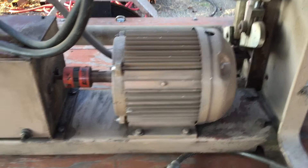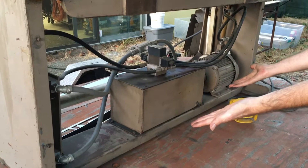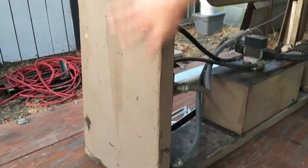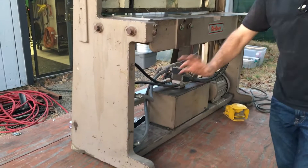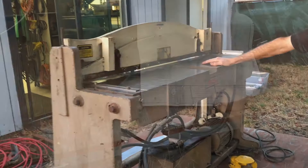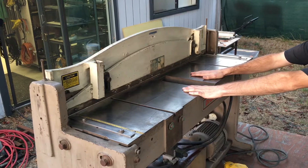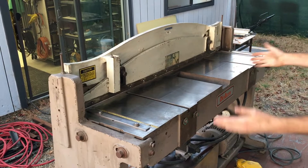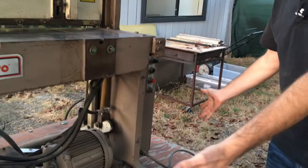It is hydraulic, so it's a 220 single-phase electric motor feeding into a hydraulic system, and the hydraulic removes the jump shear foot pedal that you normally see on manual machines. I found it very interesting that even the new machines use this exact same construction — cast iron side legs bolted into the table. According to the paperwork it's a 1979–1982 Diacro machine, rated for 16-gauge mild steel. It will probably do 14-gauge aluminum no problem, and that's a full width of cut.